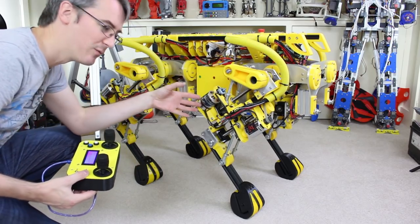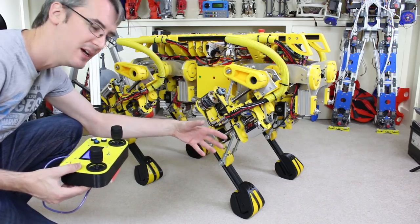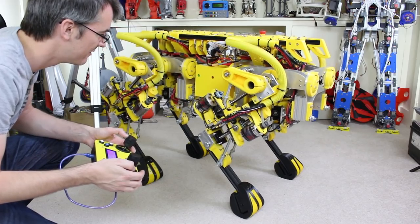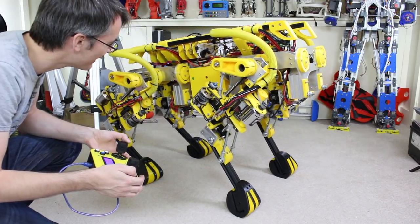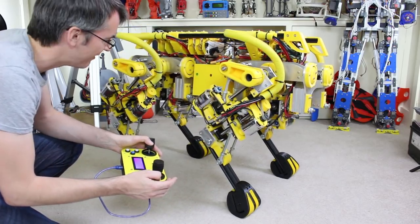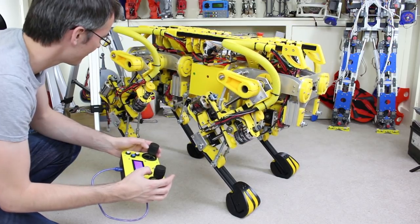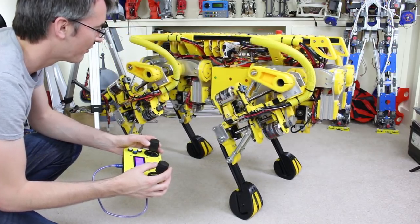While I'm there, one of the things I previously said was that the feet were too long before, and now I've put the extra 15 millimetres in — that's why it was creaking like an old ship, especially when it pitches and rolls, because the maths is right but the robot was wrong. So we can now test those axes. I'm just going to pitch it — yep, that definitely doesn't creak as much anymore. There's a little bit there, and that foot did move on the floor. We probably need to check the maths for errors, but generally it feels a bit better. It's a bit creaky if I do an extreme move, so we'll have to check the precision of the code.